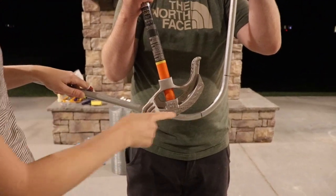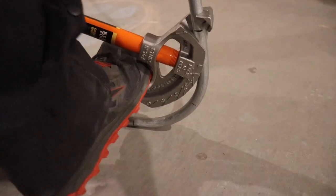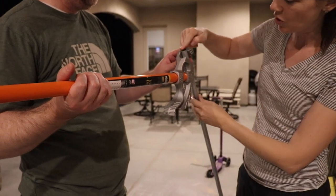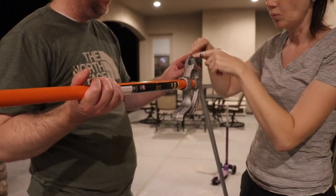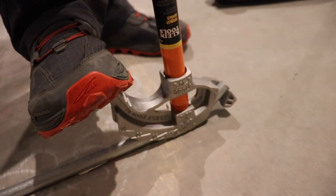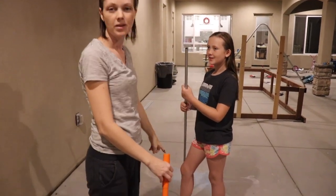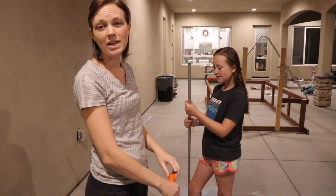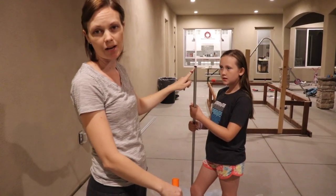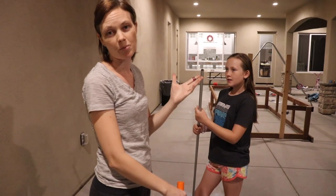Because you're bending the two angles together, you're going to get more than 90 degrees, but it's the perfect angle of what you need. We're lining up the arrow with our five-inch mark and bending towards our center line. We've got one side bent — now we've flipped it around, lined up our arrow again, and we're bending the other direction towards center. To get our 45-degree angle at each end, we are just lining up the end of the conduit with the end of the pipe bender, then bending back until it hits 45 degrees. It's helpful to have another person stand on parts of the tube to help keep it steady.